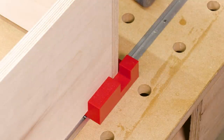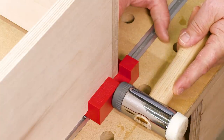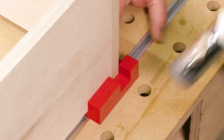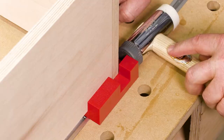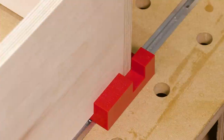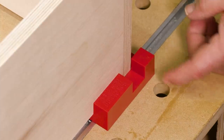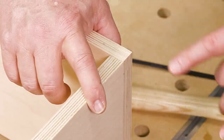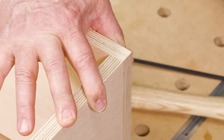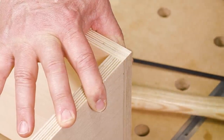Since this is locked down to the table I'm just going to tap the board with a mallet until that's dead flush, and then cinch that one down pretty tight. With the first corner fixed, we're going to work around the box tightening each corner and bringing it flush. On this corner the long board is just a little bit past the sideboard and there's a little gap. So I'm going to nudge the gap together, then push the long board until it feels flush. I'll put a little pressure on the clamp — not tight yet — then tap it with a mallet to close the gap, and tighten up the clamp. Down by the clamp the joint is perfectly flush in both directions, but up at the top there's a little spring in the material that I can close with just my fingers. We'll put a box clamp on top at the end to close up any remaining gaps.